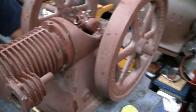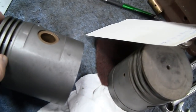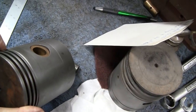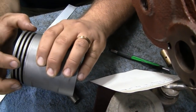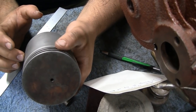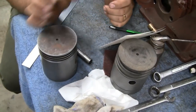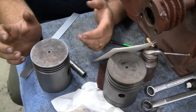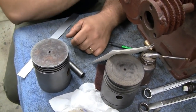Right. So okay, our next thing is getting that down in size. Turn that piston down and make it fit the bore. What's it got, a crack in it? No, I was thinking it's got that ledge on there. Would you just have to bring it down to that ledge or less? Well, we might have to go a little less. We'll have to measure. We know that this area drops in the bore, but we don't know what the clearance is. The clearance might be a little bit too tight. So we might have to take the whole piston down. We might not. So what we have to do is measure the bore accurately and figure out what kind of wall clearance we need. So if it's 2.5 thousandths, 3 thousandths, or whatever for an iron piston and an iron bore. So okay. All right.